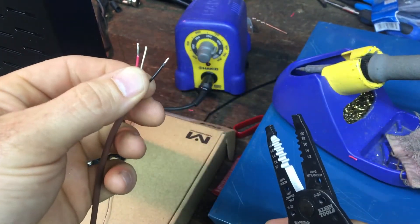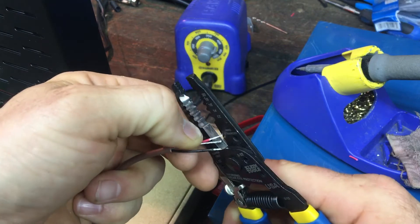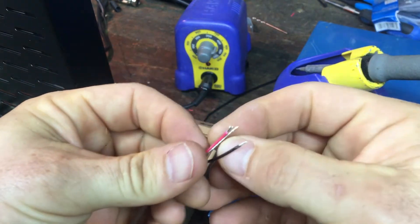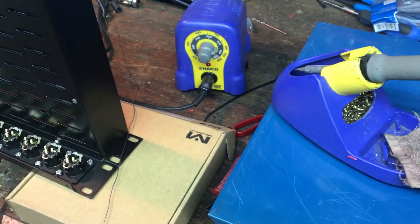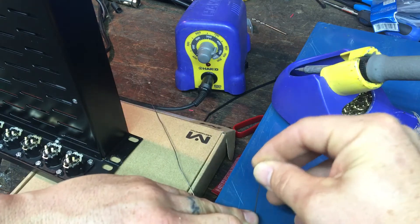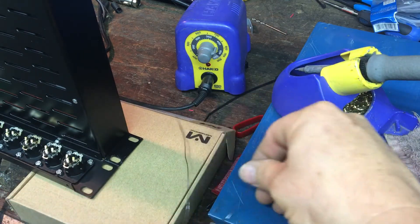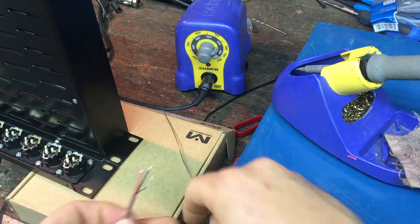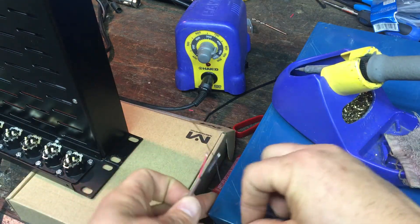I stripped — the black is what I would like to strip in length. So I'm going to cut this red down a little bit. Ideally all of these wires are the exact same length. Now the most important thing about soldering to me is tinning. What I want to do is get these fresh wire tips wrapped in a layer of solder that is completely molten.